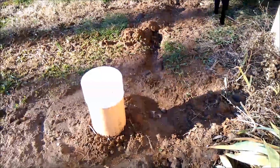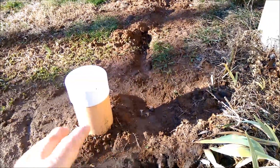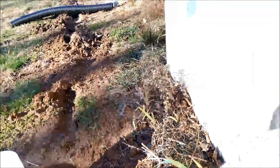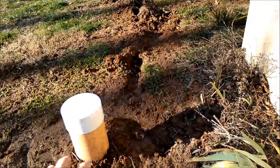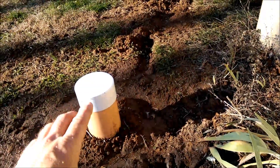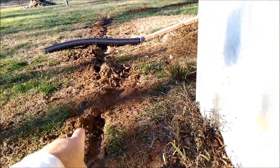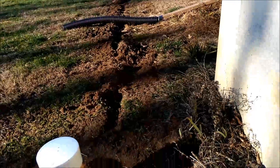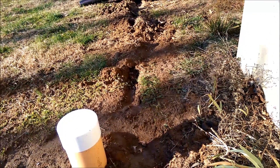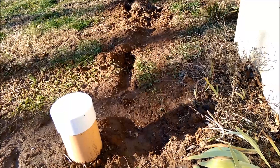On the last hydrant with the finished concrete base there was one of these with a cap. A couple of people commented that we should insulate them in case they freeze. We don't have that problem here — it doesn't get that cold — but I'm going to stuff some alpaca wool in there just to be safe. That's a drain valve down there. This is the lowest point in the system, so if I ever need to drain the water out of the piping I'll shut it off at the tanks, come over here, hit this, and it'll drain out — useful for maintenance.